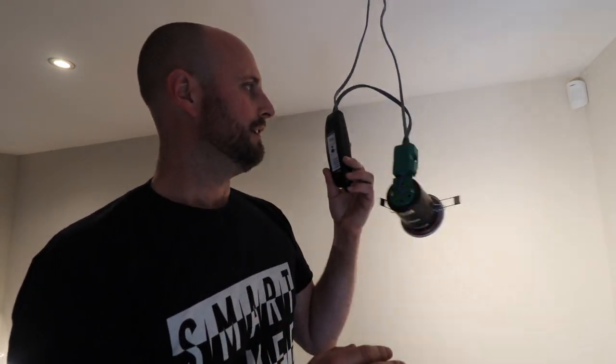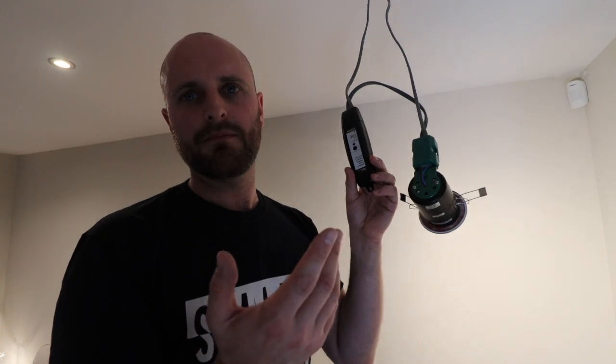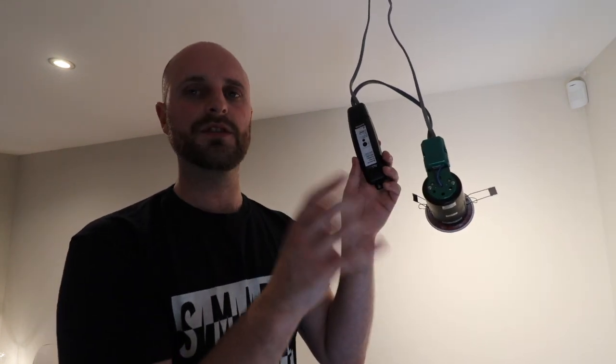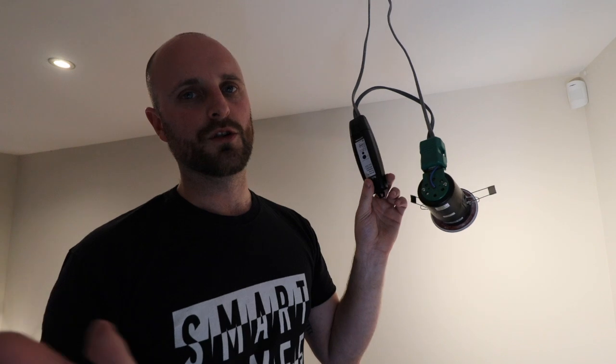But all being said, five minutes — if that, maybe three minutes — to actually install and put up. Leave this down for the time being while you program it. With Lutron you don't have to press buttons to ID or anything like that, but we'll talk about that in part three. Leave it down because if you do have any issues or problems, it's a pain to take it back down. So get everything ID'd up, put it all back in the ceiling in one go, and then you're gravy.